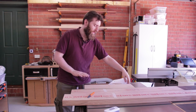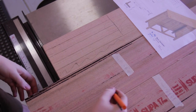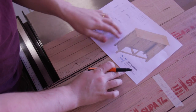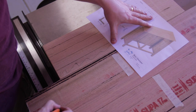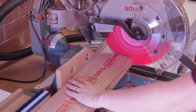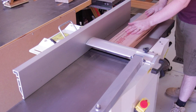I've got my drawing for the design for the cabinet and with the timber I've got I've started marking out roughly where all the pieces are going to fall. I've used both a pencil and a pen. I'm going to start by breaking down this long board into shorter sections that are easier to handle, and then I will probably rip a lot of it at the bandsaw to get it into a rough size, and then it's going to be more manageable on all the other tools to actually get to the final dimensions.